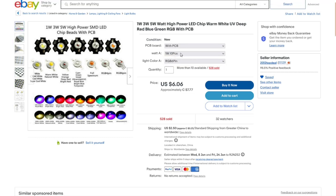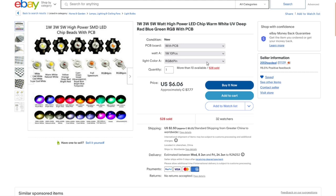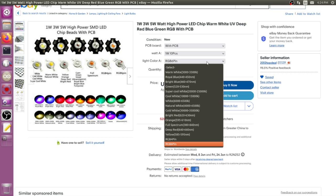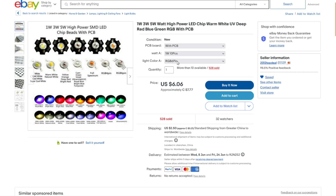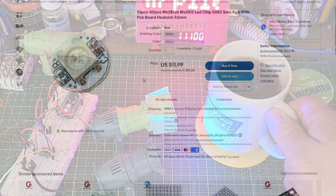The LEDs are available in all sorts of places — I'll put a link in the description, though it might be a search term to get you close. To fit properly into the housing, get the one with the PCB — 1-watt is probably bright enough; I wouldn't want to heat it up too much with a 3-watt. You can get any standard LED color or the RGB version. For completeness, there is the WS2812 version on these little PCBs in white or black — I just happened to have white ones. Fifty of them for $15.38 Canadian with free shipping is not too bad at all.